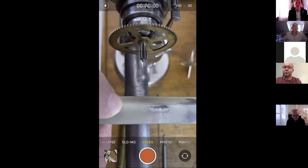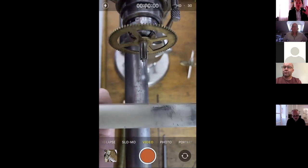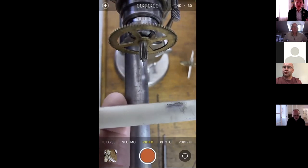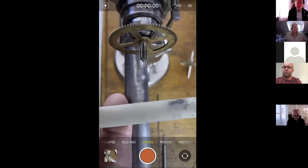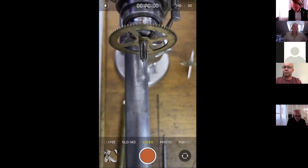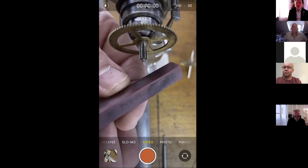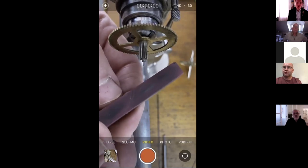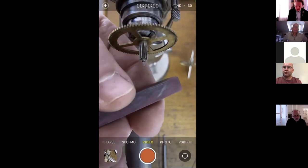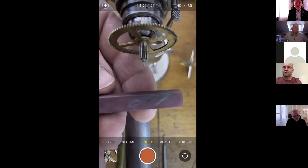The restriction of this, and I suppose you could sharpen it on a diamond stone or something, is that the corner I found wasn't particularly sharp. So the problem was that when I was improving, I don't say polishing because it's not polishing, it's fine grinding, I suppose, abrading, it wasn't sharpening the corner out properly or good enough. So I moved on to our good old friend, the Degussit stone, or however it's pronounced, which is a ruby, basically. It's a synthetic ruby composite that's all squidged together, no doubt under a lot of heat and pressure. And again, I found the problem with this is it's difficult to see where you're working with the stone because it's quite dark red.